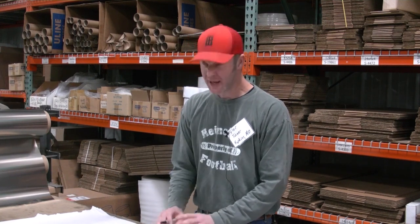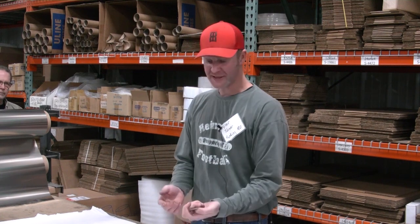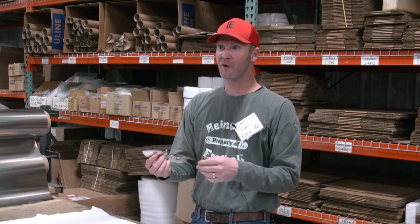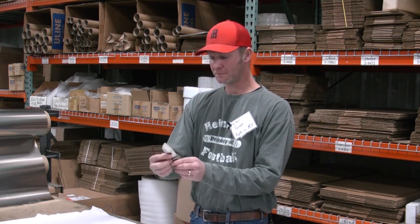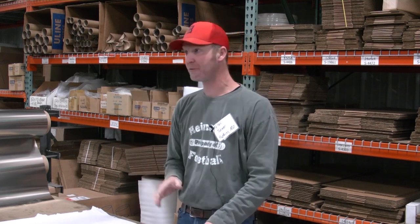So get in, grind, get up to that scribe line. Just barely get to that scribe line. Put your knife together. I always have one frame here and then the stop pin, and I always kind of fit it. You'll grind this thing, put it in there, and then you'll go, oh, the lock bar will go clear over. Well, it's not put together, don't worry, it'll be fine. But put it together, and if it doesn't lock up when you just cycle the knife open like that, if you gotta slam it, it's not there yet.